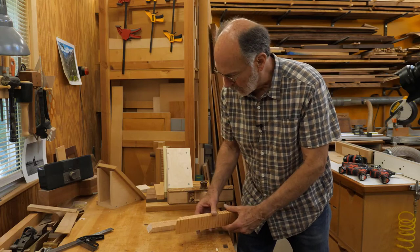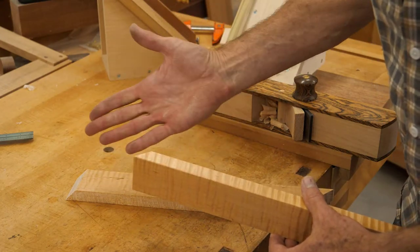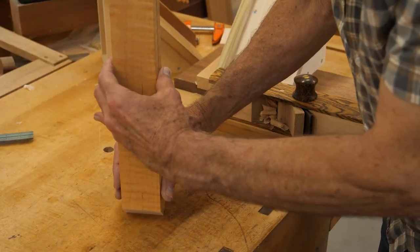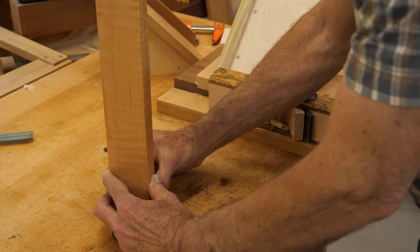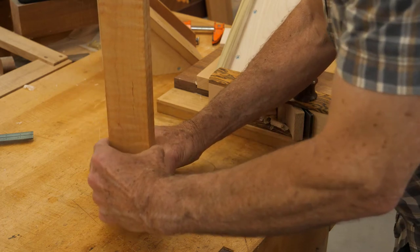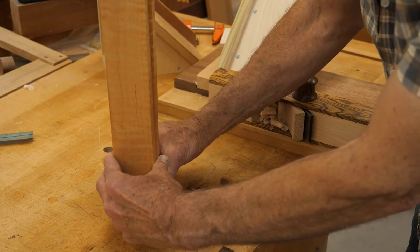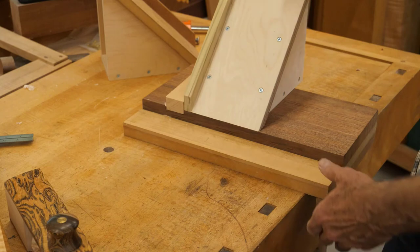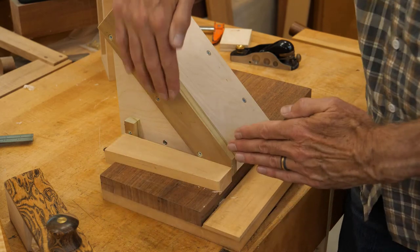In order for this to be working correctly, two things have to happen: the cut needs to be square, and it needs to be at 45 degrees. To check for square, I've got two pieces. I'm going to set them back to back so that the sharp corner is sitting on my bench. If both edges are aligned, then my cut is square. If they were off, I would have to tweak the jig by taking a little bit of material off one surface or the other to get things square.